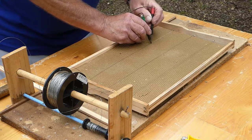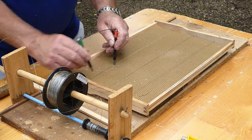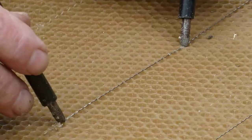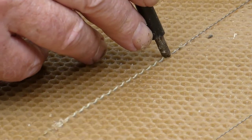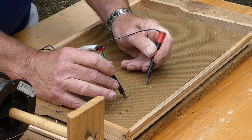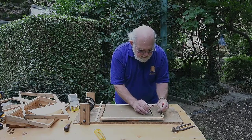It's melted in and the ammeter below me should be showing about five and a half to six amps. If I dead-shorted this it would show about eight, but of course the wire has resistance so it draws less current. One thing to keep your eye on is the probes, because they get a lot of wax on them and sometimes may not make contact. So keep a little piece of sandpaper which you can rub them on occasionally to make sure they do make contact. On these two little probes I actually have a small LED which shows me when I switch them on that I have got current going — because it's a real pain if you go through all this process and stand here trying to push the wires in with no current flowing.